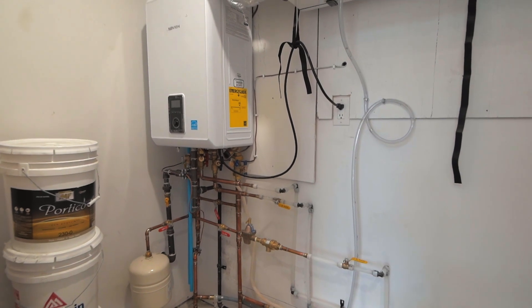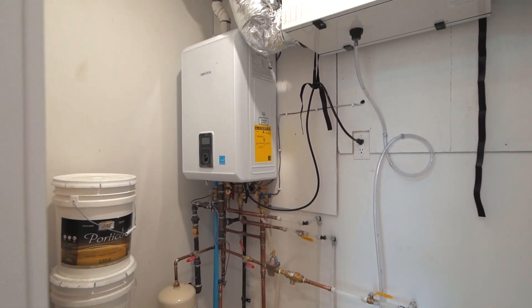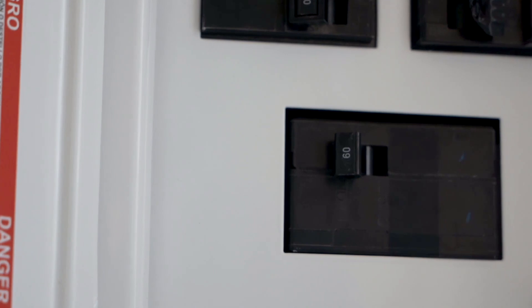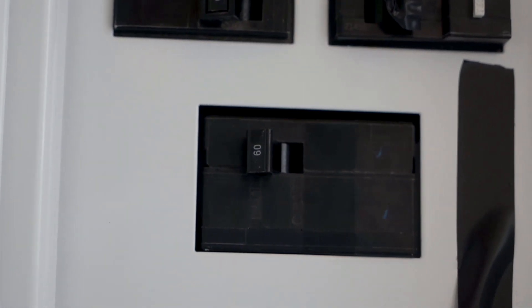When our clients encounter this issue after the fact, they sometimes resort to changing out the heating systems and certain appliances to reduce the total load requirements. Now let's discuss the meters to the main service panels. If you have one meter, you would typically have one main electrical panel servicing the entire property, and you may have individual sub panels or auxiliary panels.